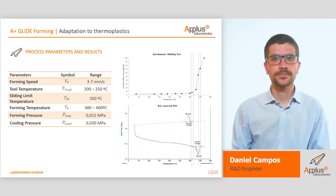In the following table, we can see some of the parameters used during this proof of concept. I must highlight the forming speed, which is between 3 to 7 mm per second, and the tool temperature. In this stage of development, we need to preheat the molds to 200 to 250 degrees in order to help the blanket reach the target temperature inside the part without spending a huge amount of time. In this particular case of study, an L-shaped preform of 3.5 meters long could be formed in 22 minutes.